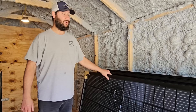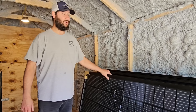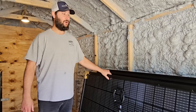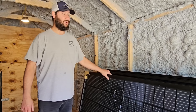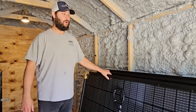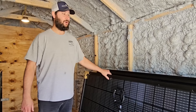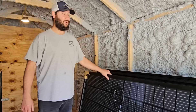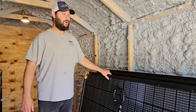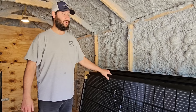Now we're going to mount the indoor unit — the indoor wall mount air handler, which weighs around 20 pounds and is pretty light. First, take the Phillips screw out of the wall mount air handler so we can remove the mounting bracket. Make sure you know which side the drain is on and which side the line sets are on. I'm going to swap the drain tube from this side to the other side so both the drain and line sets exit on the same side.